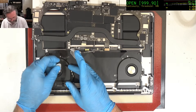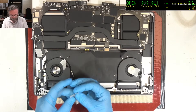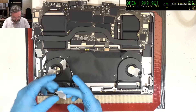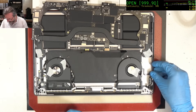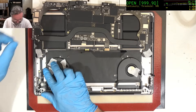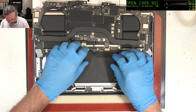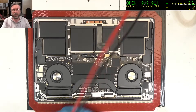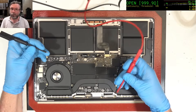This will definitely be one for the books — to have the V-reg so damaged with continuity going between PP bus and 2V5, or at least it's seen that way to some degree. If that lives, it's definitely going to be a backup straight away, because I don't know how long those NANDs would survive. Before firing up, check our resistances again — I know it's pedantic but believe me, you want to do this.